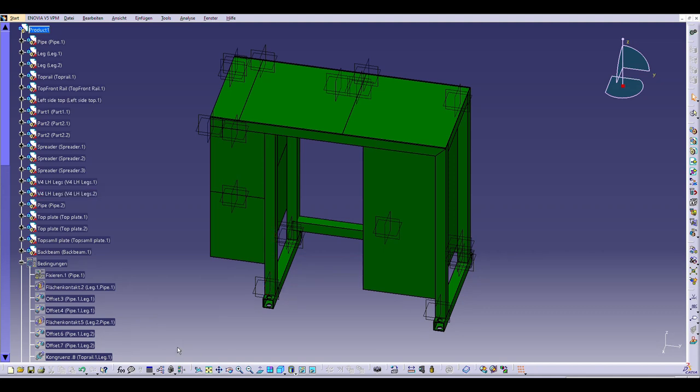And here we can see that simplified design. Now the legs just go straight to the floor. The control cabinets will be overhung to the left, but they're bolted straight to these legs. Most of the weight of the lathe is in this area, so it's really only the motor that'll be overhung to the left as well, so I think that should work fine.